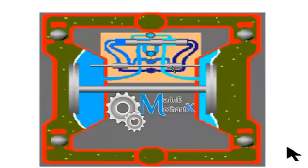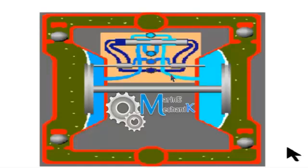Alright, so now the air pushes it, so the diaphragm moves and then this starts to discharge. Now let's concentrate on the air distribution unit. Here is the main air. This main valve has created a passage, or both the ports are connected, so that it comes over here. When you look at the other side, this is being blocked. The main air cannot pass through this main chamber to the other side of the diaphragm, as the main valve is blocking it here. Let's watch it once again.